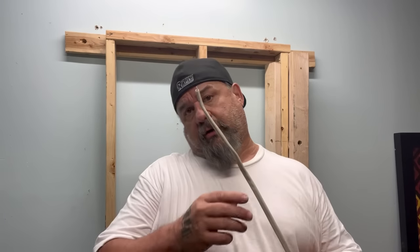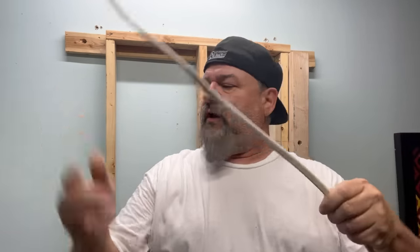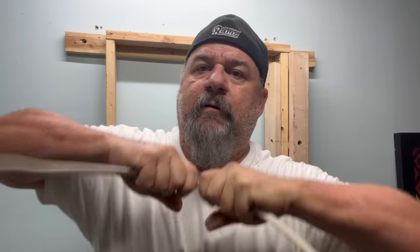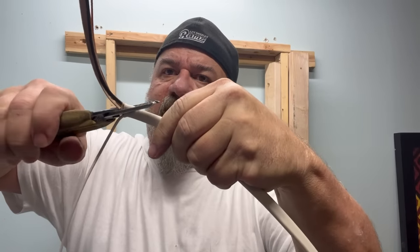We know we can't go around a really tight 90 like the other easy one. What I do — I have about a foot and a half of romex — I'll gently score the outside sheathing because we're not really going to use this tip. Break it up a little bit, pull it out. I'm going to split two wires and cut them at an angle. I'll cut these other two wires out at an angle with my strippers. I've got a little bit of an angle, and I'm going to tape it off so when we jam it through the wood it doesn't bind up. We want to make this as smooth a transition as possible because this part is going to bend around that 90.